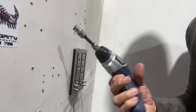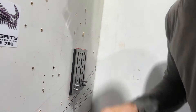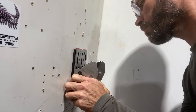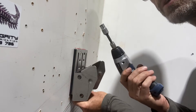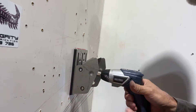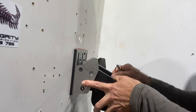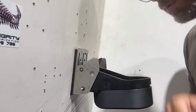What you need is a 10 millimeter socket — one of these is handy. You're better off firstly just taking out the pins because it just makes it a whole lot easier. Pins out, bracket on. I realize you can't really see what I'm doing here, but I'll show you in a sec. Get your socket — bracket's rock solid. Put the transducer back on.